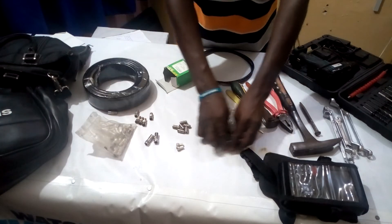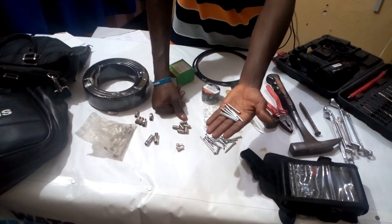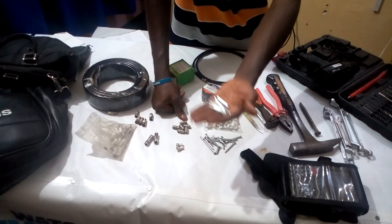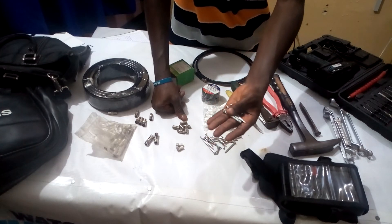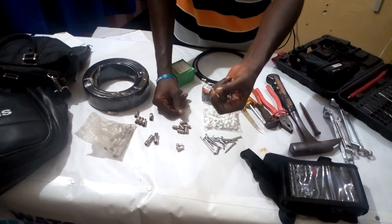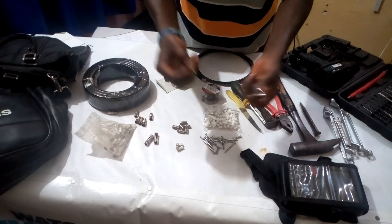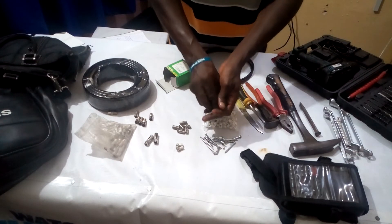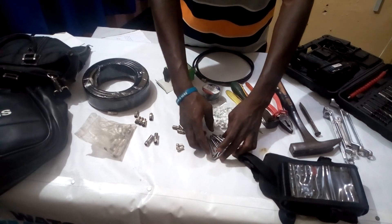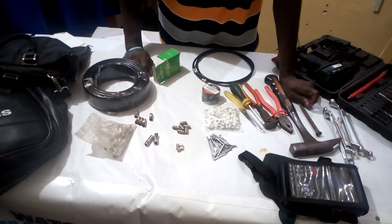When it comes to installation we also use this concrete nail — two inches. I use two-inch nails a lot because from experience I've found they last in any installation. If you use them to nail a dish against the wall it stays longer and is more durable. Some installers use one-inch nails, which are not as good — when heavy breeze blows the dish can fall off. I make sure every installation I do gives the client durability of one year or more before any maintenance is needed.